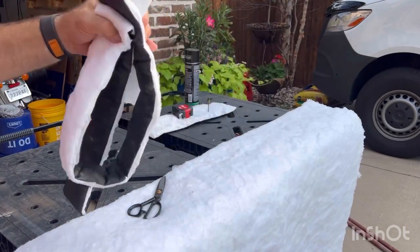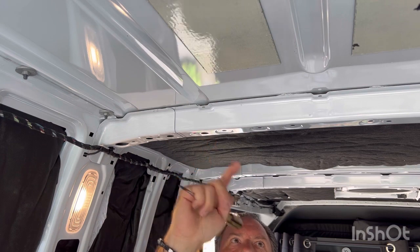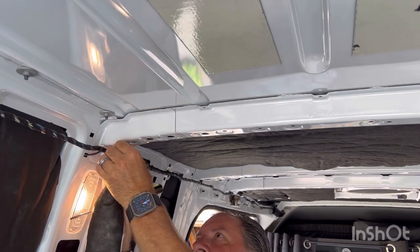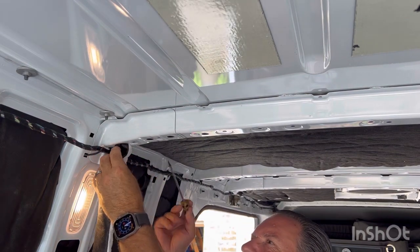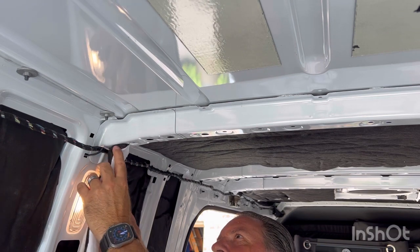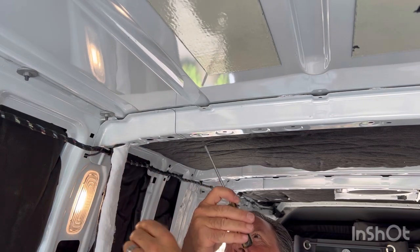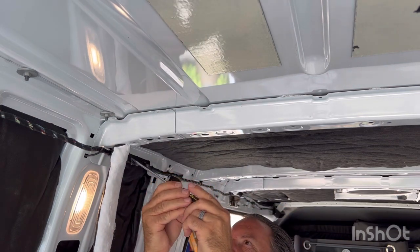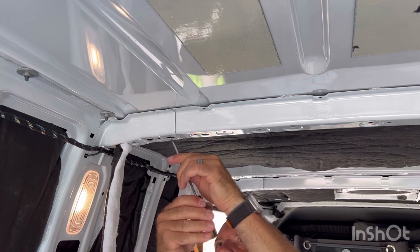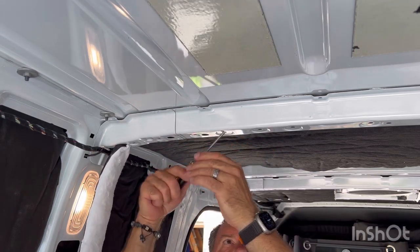It's a little bit longer than 48 inches — that's okay because I can bunch it up in some areas and it can handle a little bit extra insulation. Here's the technique: there are probably around 10 holes in this support that'll help the process. You just get it going, stuff it up in here, use your screwdriver, push in, and then slide it along. Take another hole along the way, push it back towards where you stuffed it in so the screwdriver slips it along. A thin enough screwdriver can even get into the littler holes.